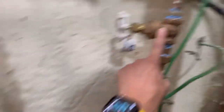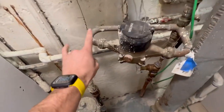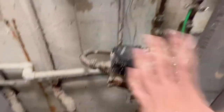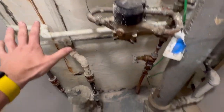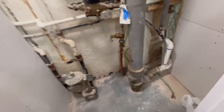It really came out nice. One-inch K-copper gate valve with flared joint — all this is coming out. This meter setup, no good. These setter valves, no good, we don't use them anymore. Hanger, no good. Pressure reducing valve coming out. We're going to redo this whole setup right here. We got the valve off — right now we're going to drain some water and empty this system.